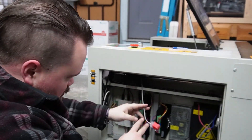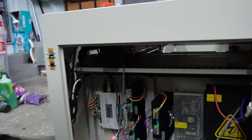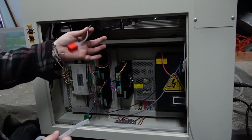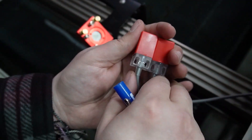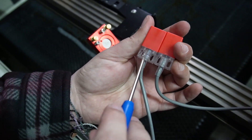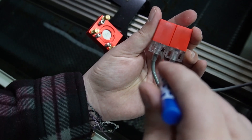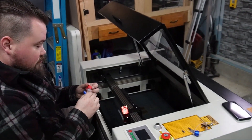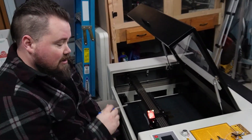Before I finish pulling it through, I'm going to get this back screwed in where it's supposed to be, then pull out the rest of the cable. I'm having a very hard time getting the limit switch back on — the screw holes just don't line up. Comparing the old one to the new one, you can tell how much bigger the holes are on the old one. So be aware it might not line up — I'm gonna have to use a file to make the holes a little bigger.